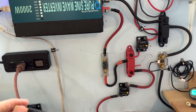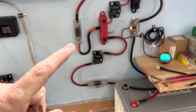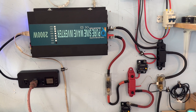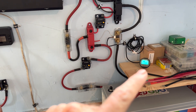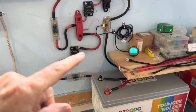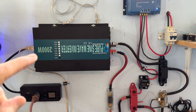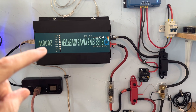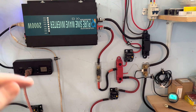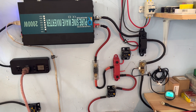I had exceeded the 100 amp rating and I should have had 200 amp fuses, which are now in place. Once I diagnosed it, it was a simple fix — I put the 200 amp fuses in, fired it up, and everything worked as it should. Battery voltage read correctly, the battery capacity percentage was accurate, everything was fine. The whole problem was, like I said, I was going to upgrade when I put that inverter in there — some of you guys even mentioned it to me — but I procrastinated and paid the price.